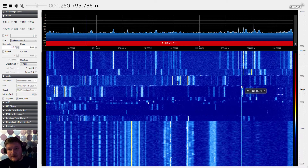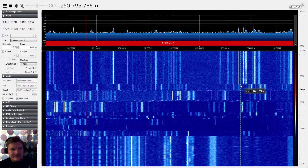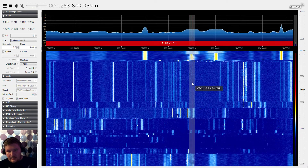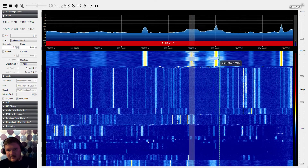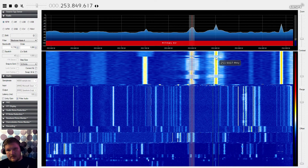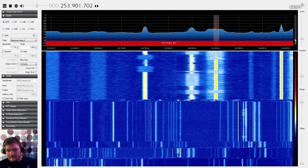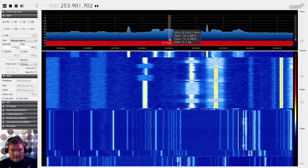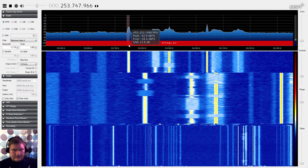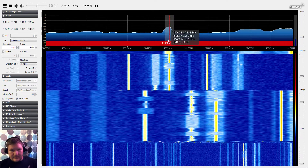There's a bit more data. It is hard to kind of do this on the spot because you can't really plan on when a pirate's going to be doing slow scan or who knows what else on the satellite. There are a couple of transponders here, and you can see how when nobody's talking on it you've got this wide 30 kilohertz span, and then in the center we have somebody who's actually keying up about 12 and a half kilohertz — that'd be your FM audio. There's definitely somebody getting in, but can't really make them out. This one's very strong and it seems to be taking up most of this particular transponder's bandwidth.